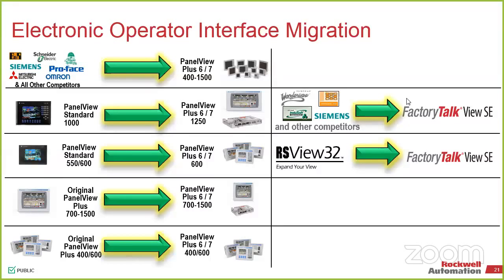It's just one connection. The performance style goes up to the 19-inch screen. You can do multiple controllers on that one. Again, it can be either a Rockwell controller or a third party controller. For any of that, we wouldn't need a gateway device. Also, letter of the law, if it's coming through the Rockwell controller first, it's a Rockwell connection. So if there's already a gateway device that exists for the controller side, we no longer care if it's coming through Modbus, because all we care about is the Ethernet/IP connection. So that's another option we have on that side.